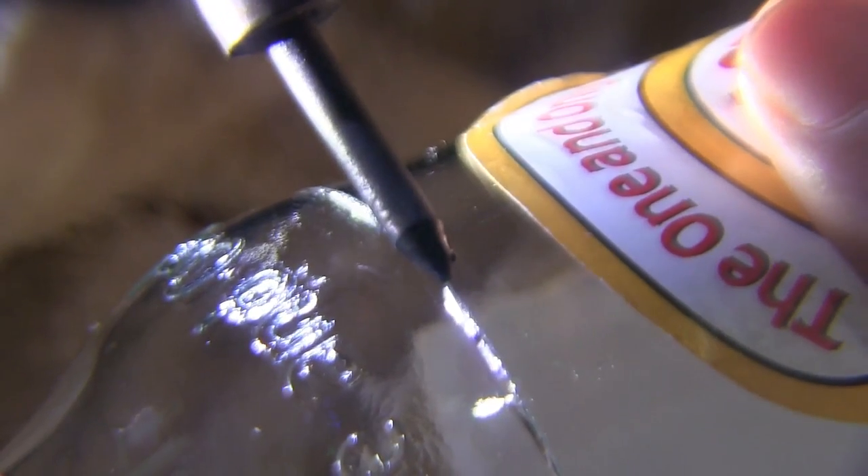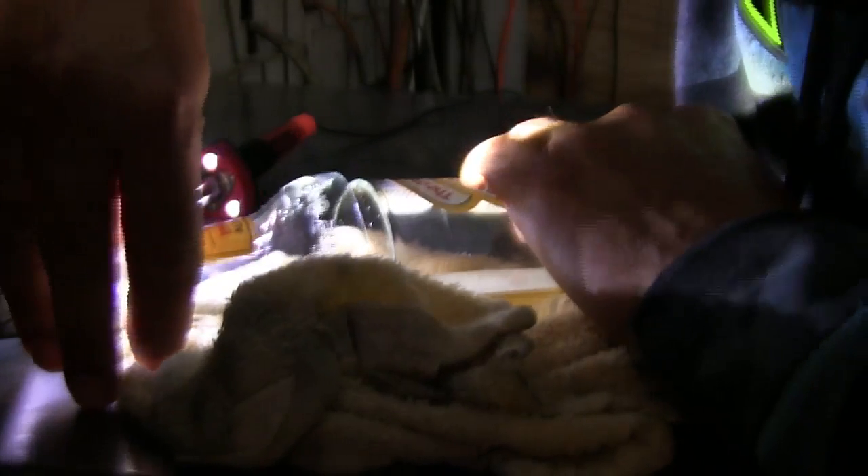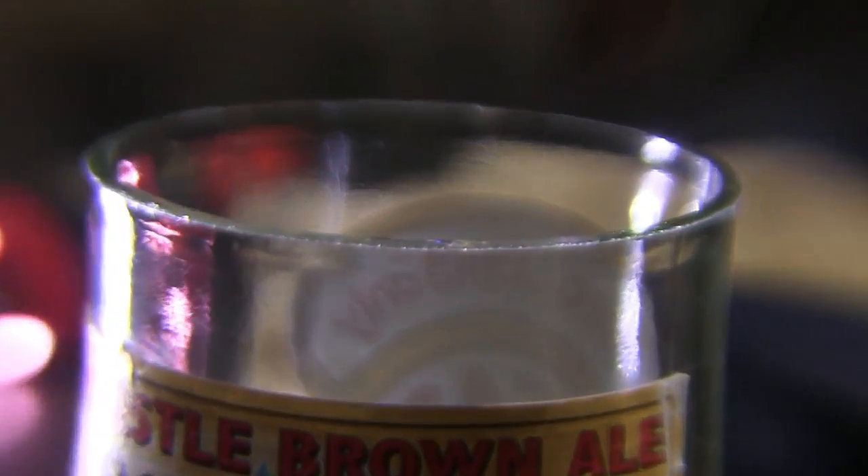Once you have a line that starts only on the score line like this, use the tip of the iron to work the score line by heating the area next to the crack. If you are doing this process correctly, the crack along the score line should seem to chase the tip of the soldering iron. You want to continue the process of working the score line with the soldering iron all the way around the bottle, intermittently using a damp or wet cloth to cool the bottle down. The first couple of times you do this, it can take you up to 10 minutes to separate a beer bottle, but once you get the hang of it, you can easily separate a beer bottle with a near perfect edge in under two minutes.